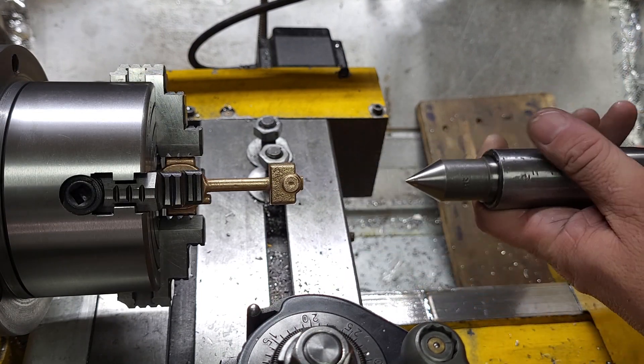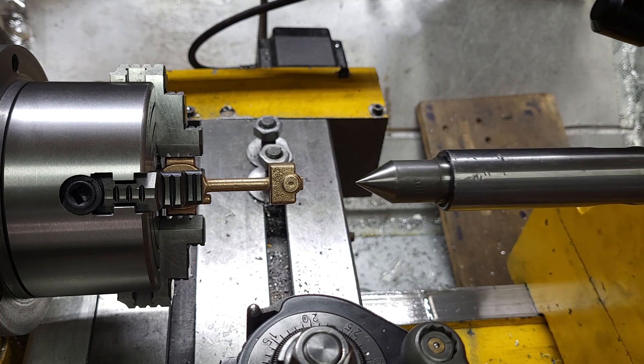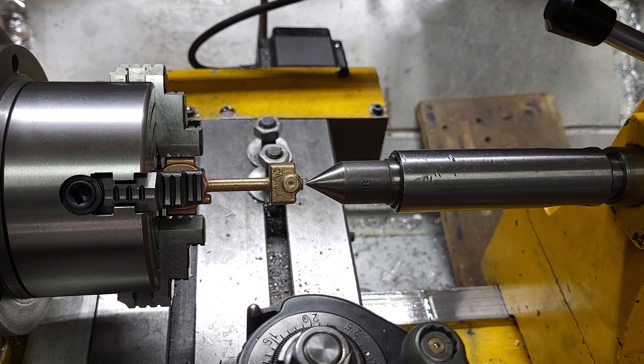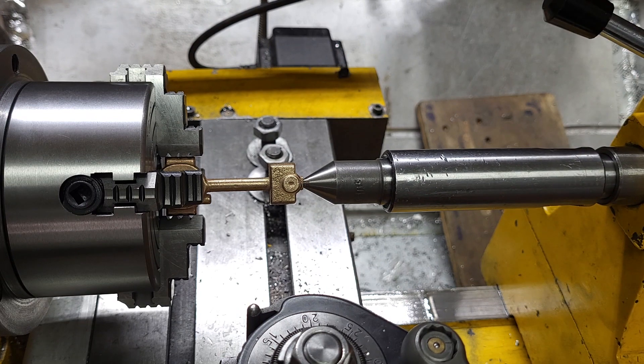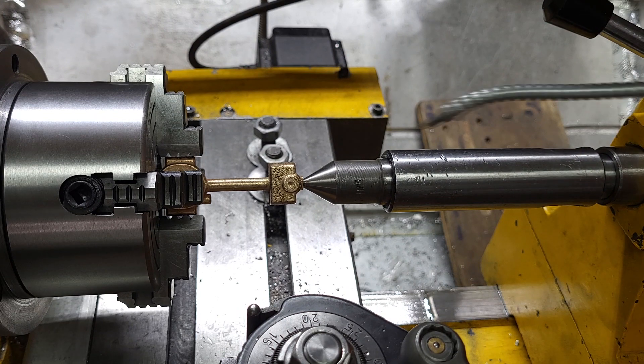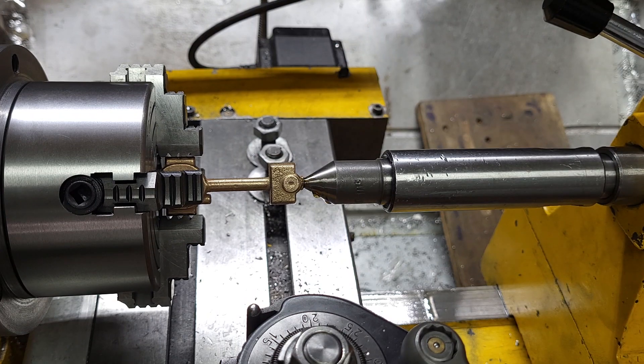At this point I should have drilled the through hole, or at least as far as it needs to go for the shaft that goes through the middle of the piston — whatever that's called — but I did that later, and I think I would have had better concentricity if I'd done it here. I have an extension on my tailstock center because the tailstock is really short and just doesn't reach.